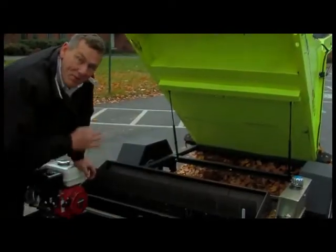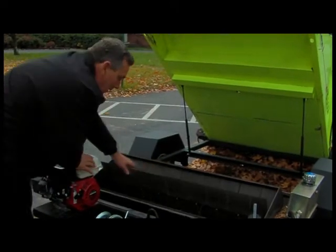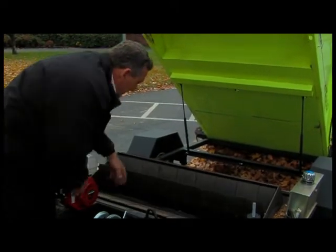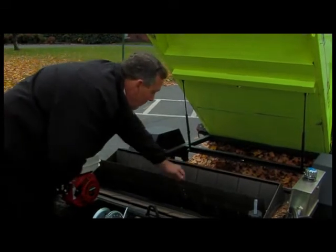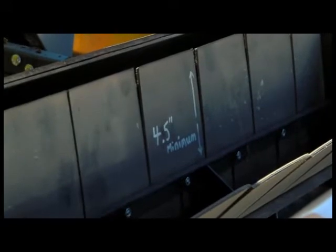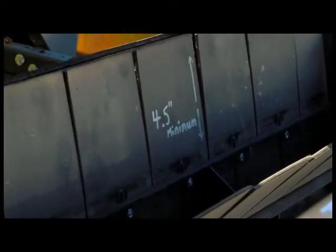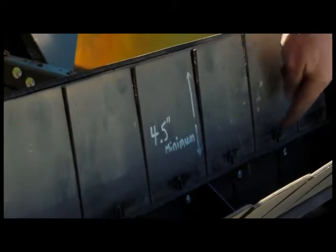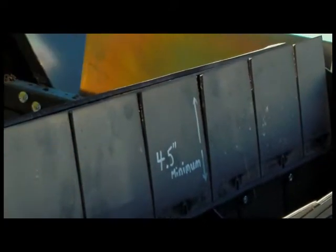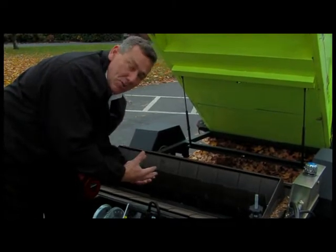Another unique feature about the Victory T500 is its adjustable impeller. The impeller blades are rubber, mounted with a clamp using these 8 bolts along this strip here. Simply loosen the bolts, slide the rubber blades out, the impeller is adjustable. Very simply, these 8 rubber blades do all the work. Adjusted a 1/2 inch off the ground, it's a great vacuum machine.